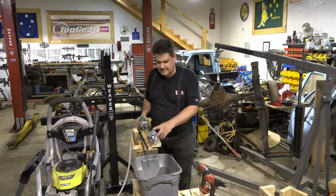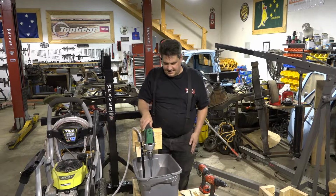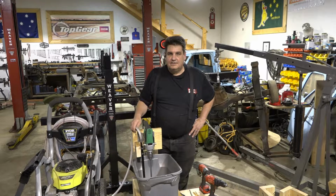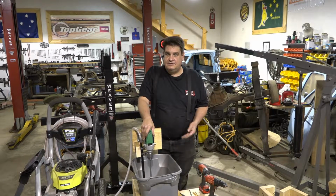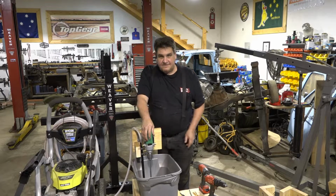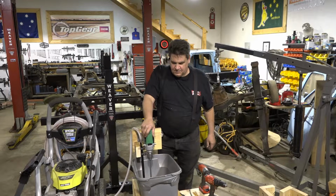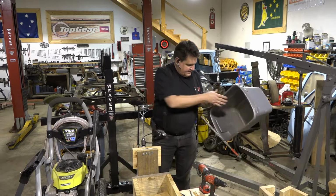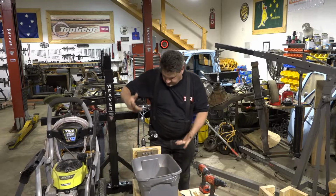And what that'll do is, it's got a little corkscrew on it, and it'll keep tumbling the sand down in there and keep it all loose, so the pickup here doesn't just suck the sand out and leave a hole. Now in theory, if your media is dry, you shouldn't have that problem, but I've had that problem. So this way we're going to fix that. And of course, if somebody walks by and spills their Coke in your bin with all your media, then we can just flip this thing back, take it out, dump it, and then it can go back in.